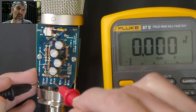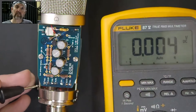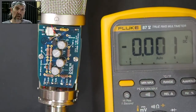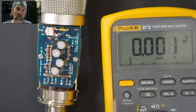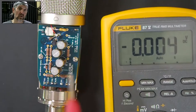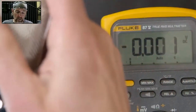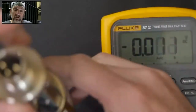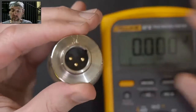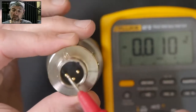If you ever build one of my microphones — or really any microphone kit — XLR pin one should be zero volts DC even when it's plugged in, because that's ground. Now, if you measure XLR pin one and see a positive voltage there, you should unplug the mic because the most likely explanation is that you swapped the XLR wires, meaning the wires from the XLR jack to the circuit board.